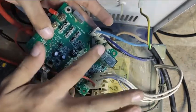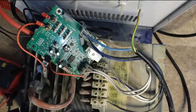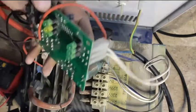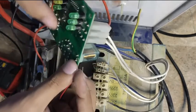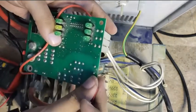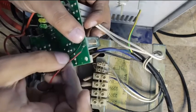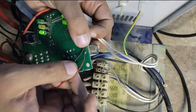Okay, let's start it manually to see if the relay is working or not. This is a 6 volt relay, so if I give 9 volts to its coil it should work — if the relay is okay and the rest of the circuitry is okay. Let's check it properly. As you can see, it is working. That means the relay is okay.